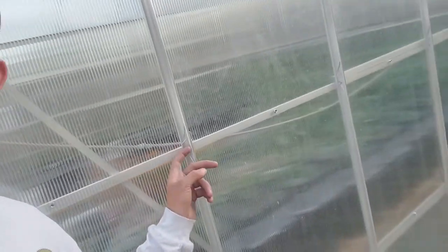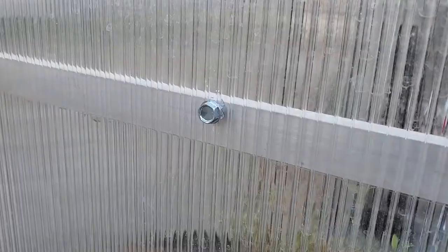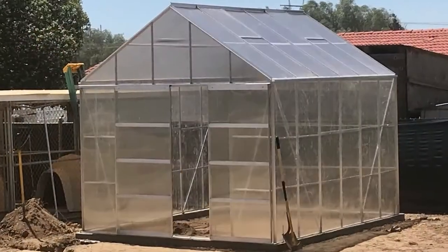There's one more little stability issue that's common with these greenhouses: the panels often unclip and can blow away with a good gust. So we put a simple number 10 tech screw in each panel, and that's fixed. The construction of this thing is pretty basic — you get your frame all set up and from there you put your panels on. Pretty straightforward.